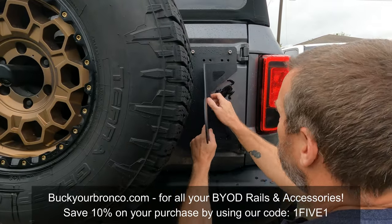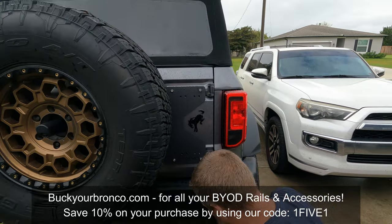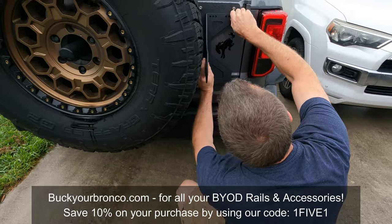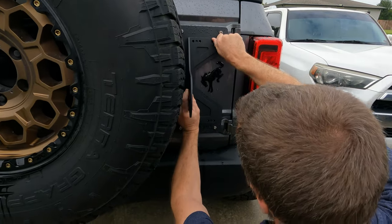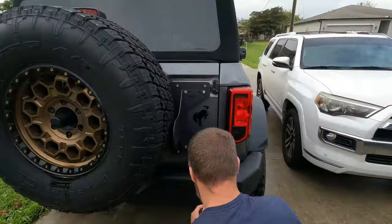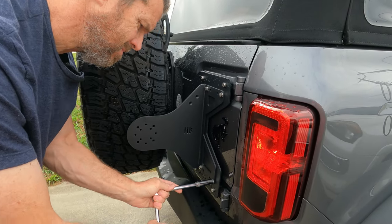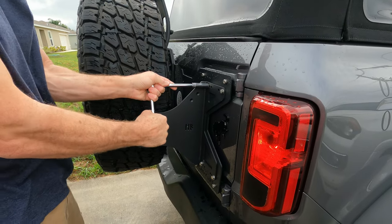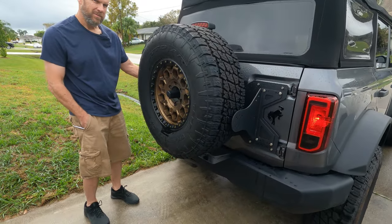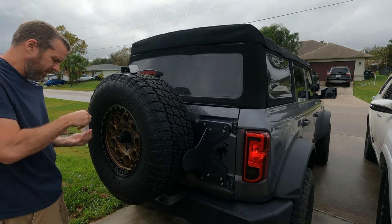Joe wants to hold the extra bolts so I don't have a bunch of them lying around. These are stainless steel bolts — yeah, because we live in Florida where everything has salt in it, including the rain. He does it in a crisscross pattern so it lays even, no twisting or bending — habit from working on jet engines forever. You really do it in a crisscross pattern.